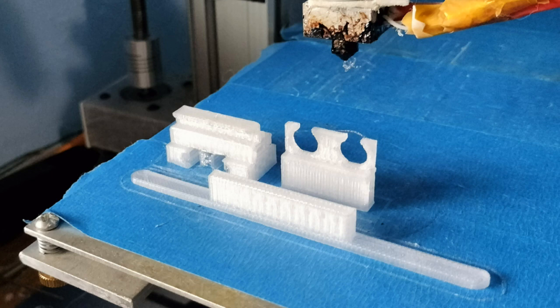3D printing the parts. Here are the supports that hold the water valve to a wire cage. If your air conditioner has a different sort of housing that doesn't use a wire cage, maybe it's a stamped metal with openings, you'll have to figure out maybe some other method. You might be able to jam this thing down into the metal openings and make it stay. That's up to your discretion if you want to bend some of the metal to accommodate it. Baling wire or copper wire is maybe better. It wouldn't rust so much. Does remarkably good at anchoring things to these air conditioners. The misters, I had initially mounted my misters with just copper wire.